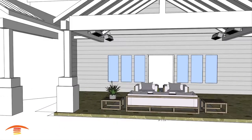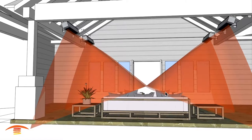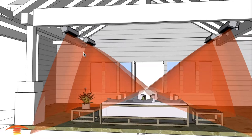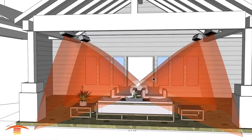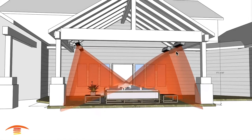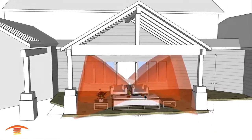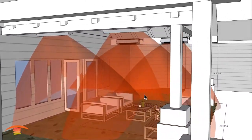Let's go ahead and look at the footprint of heat. You can see it's very similar to what I had mentioned before, but this intensity is a little bit hotter than the 6,000-watt electric heater — 34,000 BTUs compared to roughly 20,500 BTUs — so there's a lot of difference in intensity. Also, running on gas, if this is a windy area then gases will get blown around and it's not as efficient as electric heaters. If it's a windy area, electric heaters might be more effective and efficient in that space. This is just to show what the difference would look like and how I would place these units in this application.